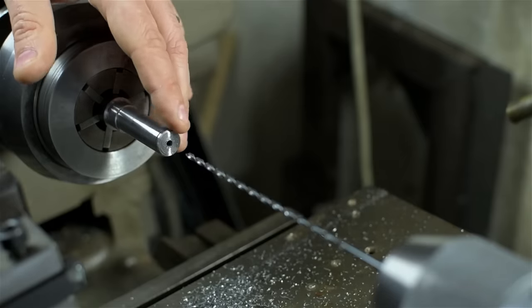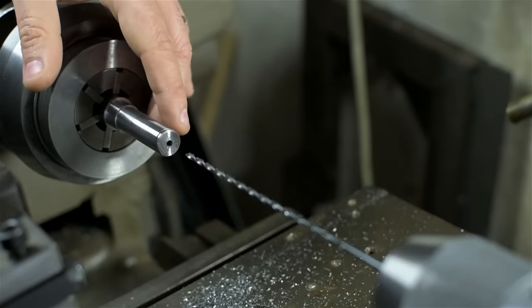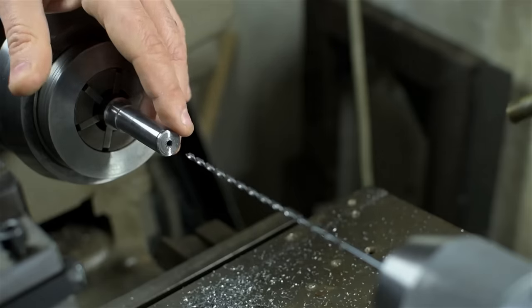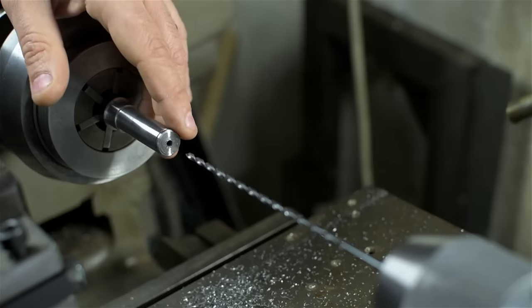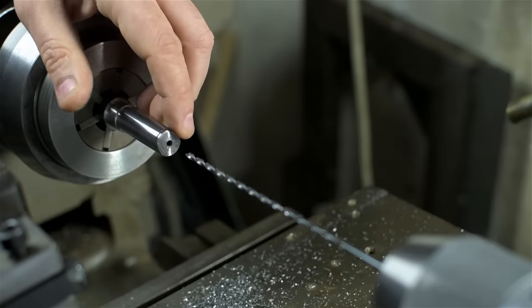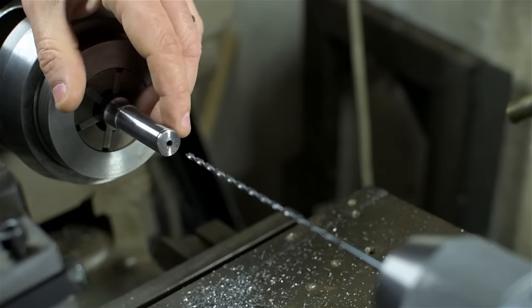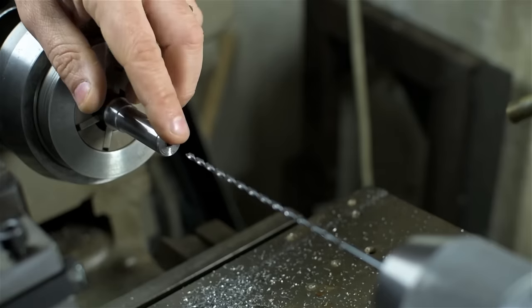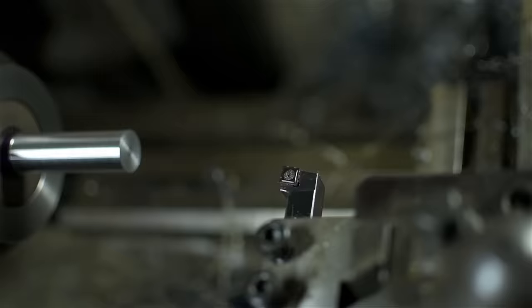As the flutes of the drill start to fill, assuming you know your lathe and are very intimate with your machine, you'll hear changes as you're drilling and maybe even start to feel the flutes filling up. Granted, if you can actually feel the chips building up in there, you're getting dangerously close to binding and snapping your drill and likely scrapping your work. Go slow, clean often. Oh, and your drill sharpening kung fu really needs to be on point.